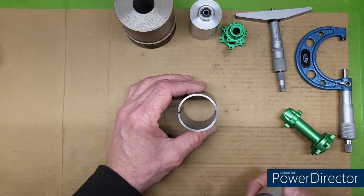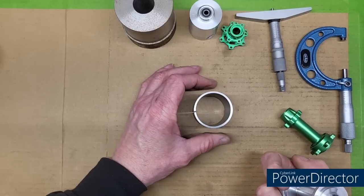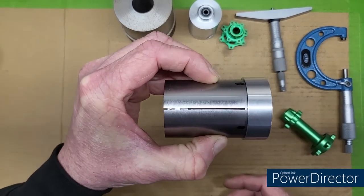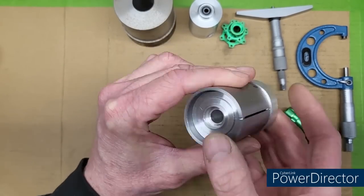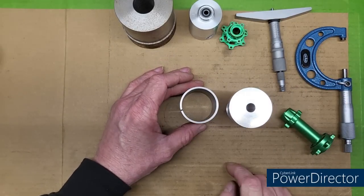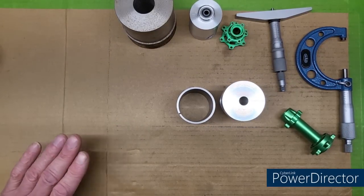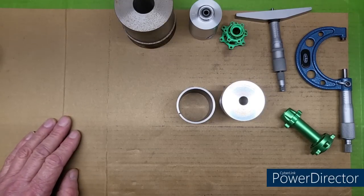So we're going to make this fixture today. The bore is highly accurate — the OD and the ID are dead concentric and highly accurate, and they have to be. This part's going to go in like so, and then we can draw it in the four jaw and indicate it in. You can't have a lot of slop between the part or you'll never get it to indicate. So we're going to make the fixture today, then indicate this into zero with the fixture. Please like, share and subscribe my videos — I'd be very appreciative of that. Let's get busy on this.